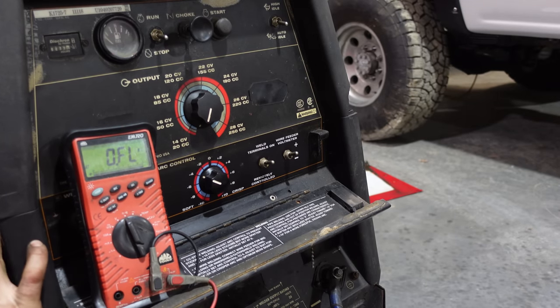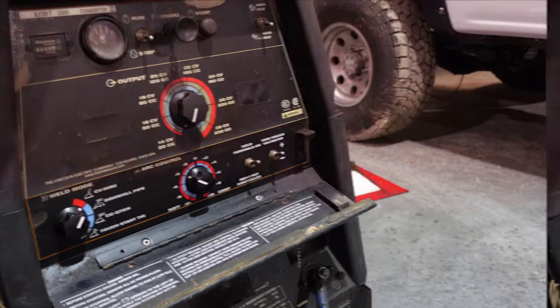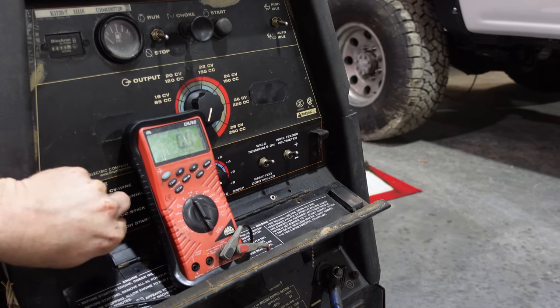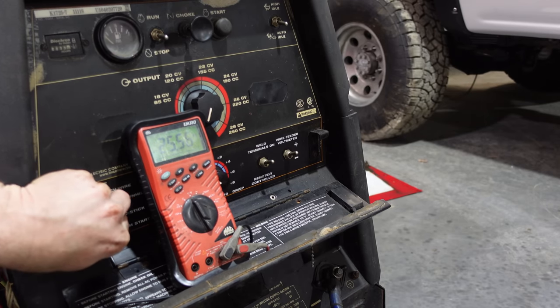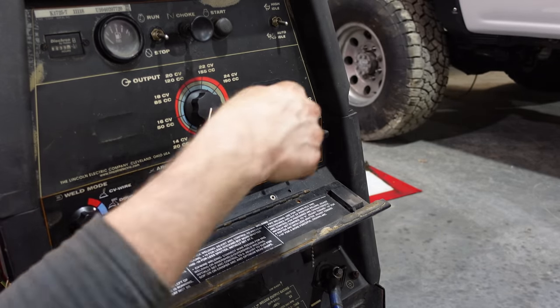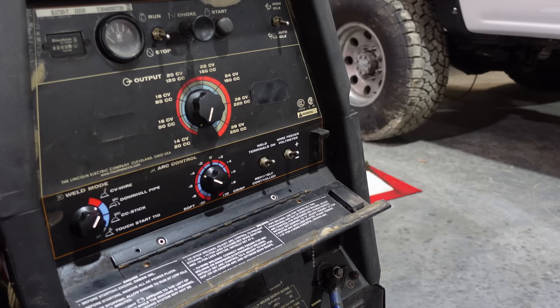That's doing something. For these four wires, I just made sure I traced them back to the plug, then turned the knob — each position should connect one wire to another wire. Yeah, that switch is working. Confirmed: that one's working, that one's working, that one's working, and this one is working.